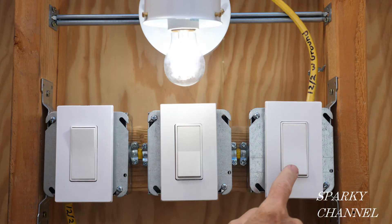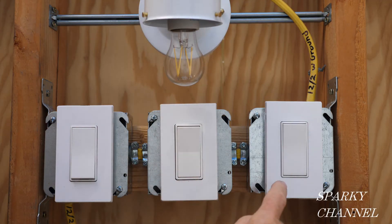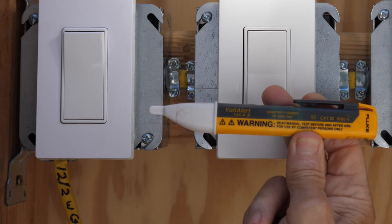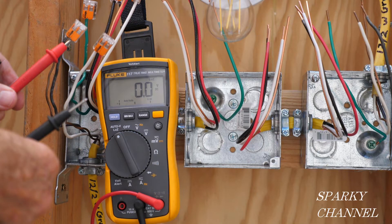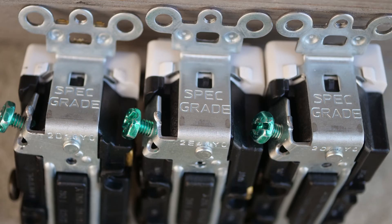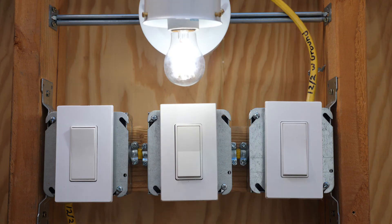That's a good start! Let's try all the different combinations — turn that off, make sure these work; turn that off, make sure these work; turn that one off, make sure these work. Everything works just great! There you have a repaired four-way switch system. I'll put links in the video description for the Fluke 1AC voltage detector, the Fluke 117 electrician's meter, the Klein five-piece insulated tool set, the DeWalt cable stapler, Klein 8-inch fan, Leviton spec grade three and four-way switches, and Wago lever nuts. Thanks — I hope this video was helpful.